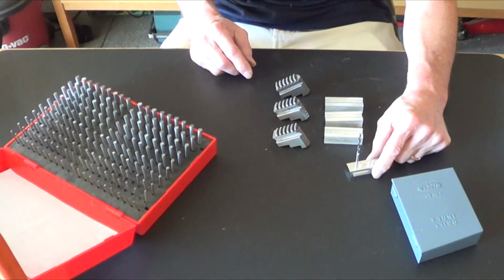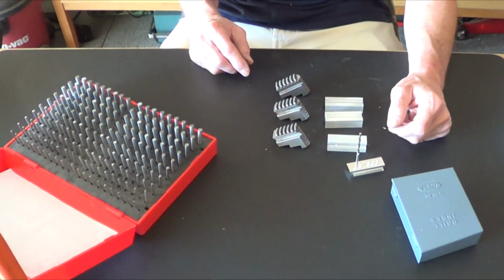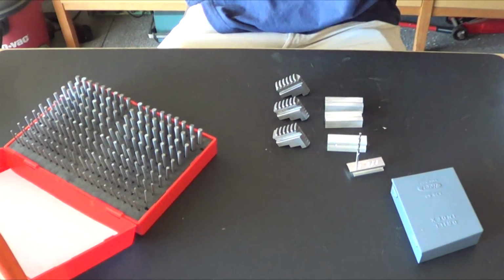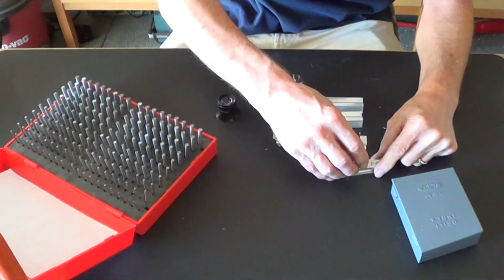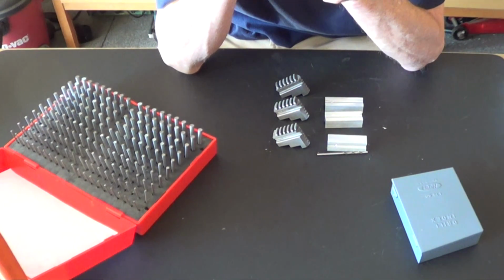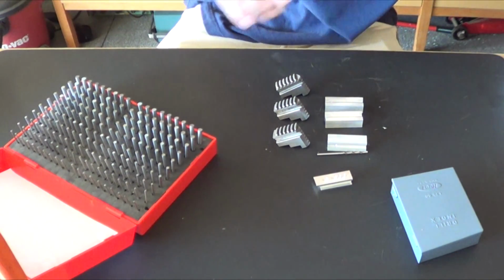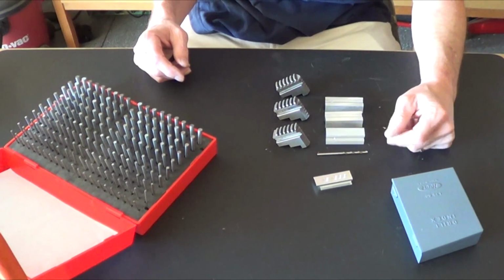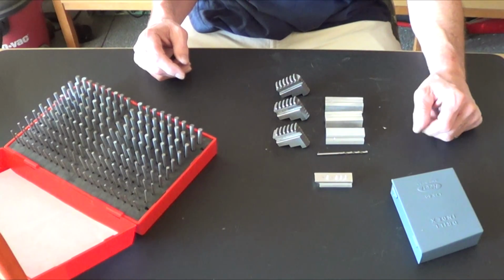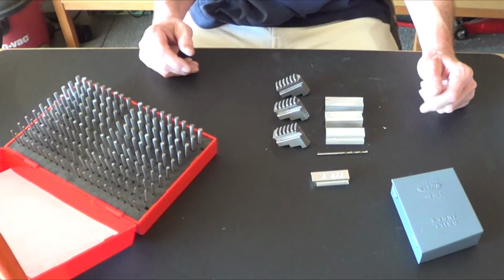So now I guess I just center up and then move in. I know I still have the blueprint for the prototype, which will give me the spacing for the holes, but what did I do with the pins? I think, look at it with the eye loop. Yeah, these aren't bought. I machined these pins. Boy, is this going to take a long time. So, drill the holes, and then I got to machine a whole bunch of pins and cut them. And then I remember I just put this in the end mill and cut them all to the same line. I had pounded them in, and they're in there. So, tight tolerances again.